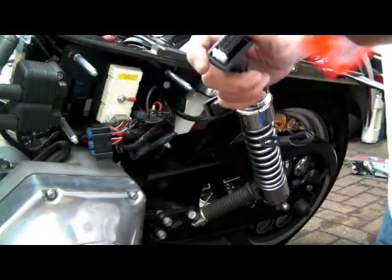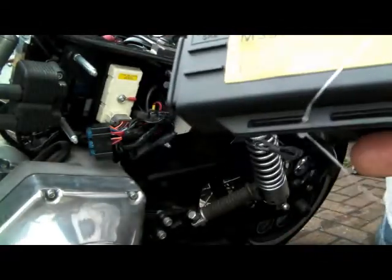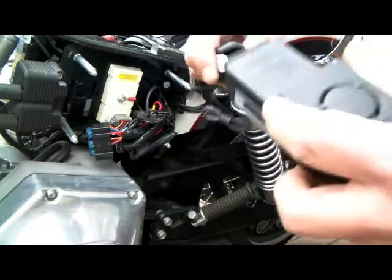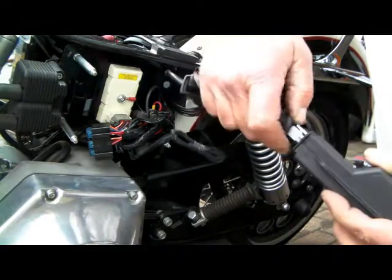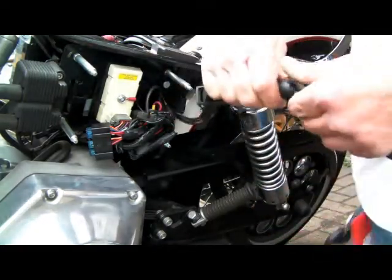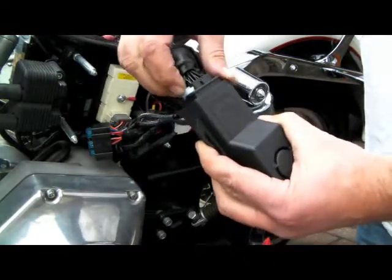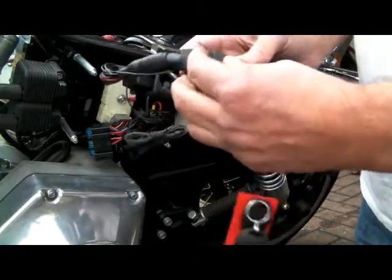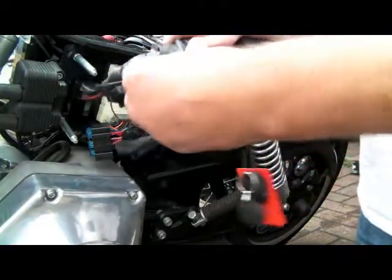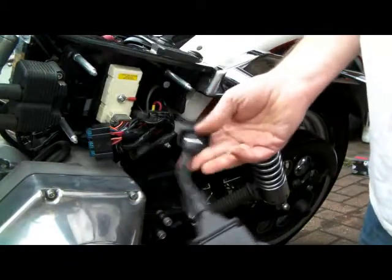Now the other end goes into the brand new M357T V2 — the latest model, three year warranty from us, new style fobs. You'll get at least another 10 years out of this one. Just insert the two plugs in there as such. It's best to pull the rubber bung back a bit, push that fully home. Most importantly, make sure that clicks in — that's the little white plug clicks fully home. Put the cover on. That's it — job done. Took, what, five minutes? Ten maybe.